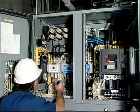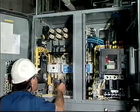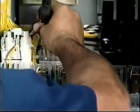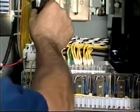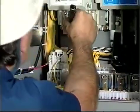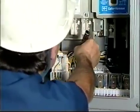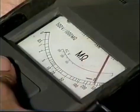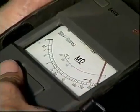Other points to check in the motor starter are signs of weakened coils, the insulation on wires, and any formation of rust on air gap surfaces of magnets of the main switchgear. Solid-state starter operation should be checked, and torque and ramp speed should be calibrated. The insulation resistance of the compressor should also be checked.